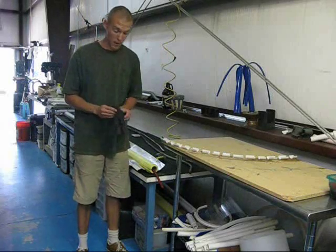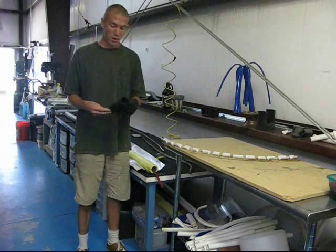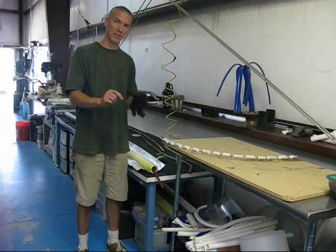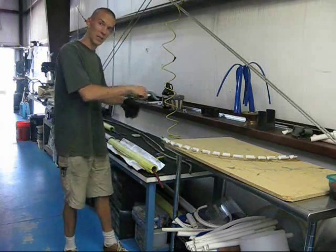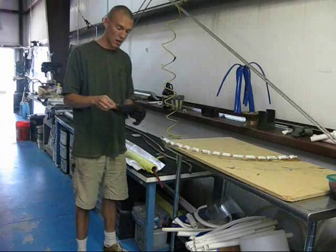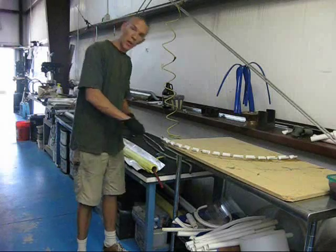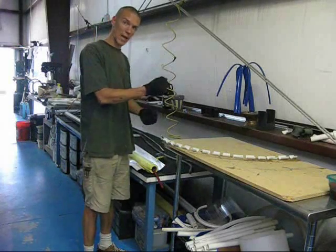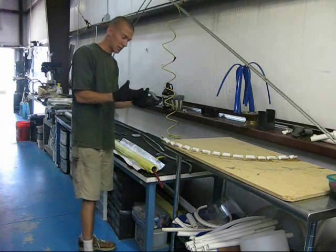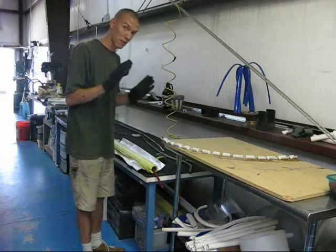It's very important to put your gloves on before you take the pipe off the bender. The pipe is at the right temperature where when you touch it, it really doesn't seem like it's hot — that's why while turning it inside the bender I'm bare-handed, because I want to know how soft it is. But when you go to handle it, you've got to have gloves on. What happens is you'll pick it up, feel like everything is okay, and then later realize you've been very badly burned, because it's just the right temperature to hurt you without causing much pain instantly.